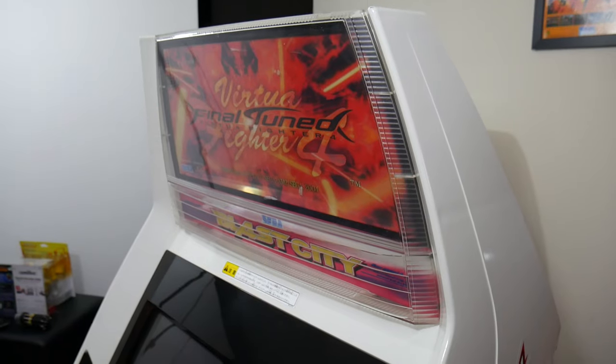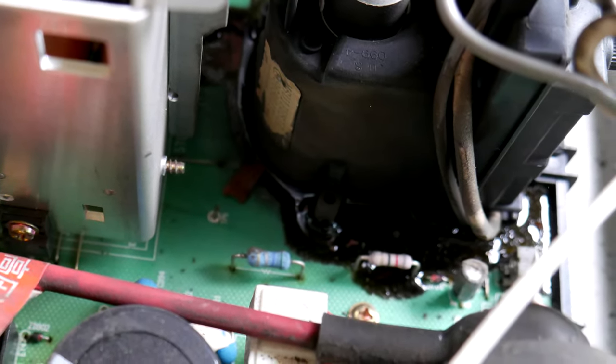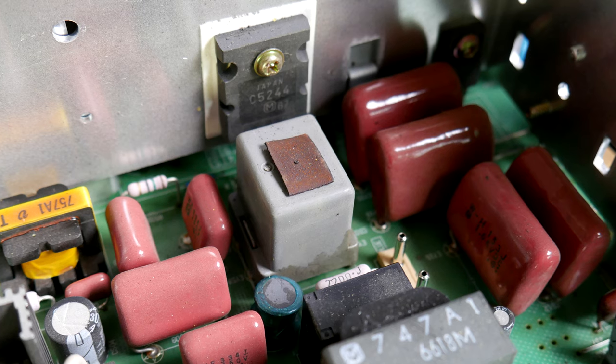Since I've been going through and cleaning up a lot of the monitors and getting them recapped, I decided it was probably time for the Blast City to be recapped as well, and I wanted to have somebody take a look at that for me. And of course, when I go to pull this thing out, I see the dreaded black goop all over the chassis. For a while there seemed to be a lot of debate about this stuff, but I think the consensus is now that, for the most part, the black goop is relatively harmless since it's non-conductive on the chassis. It seems to be potting compound that's leaking from one of the components here on the board, but nonetheless, I'm going to get this board recapped. I want this stuff cleaned up, so I got to pull it out and get it ready to be serviced.